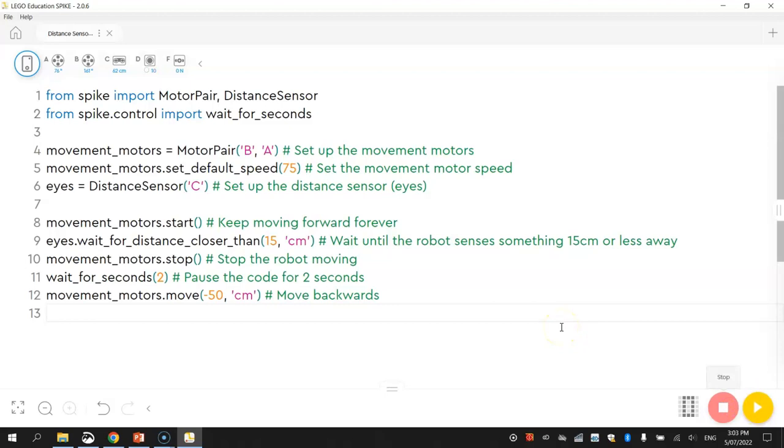In the final challenge, the robot drives forward, spots something 15 centimeters away and stops, waits only half a second, backs up 10 centimeters, spins on the spot to face a new direction, then drives off exploring again. This will be an endless loop so the code keeps running forever — the robot continuously navigates around the room avoiding obstacles.